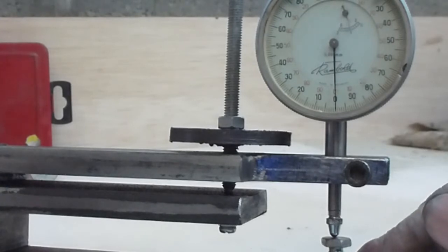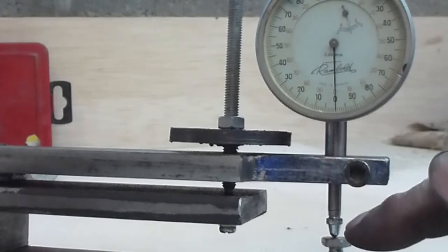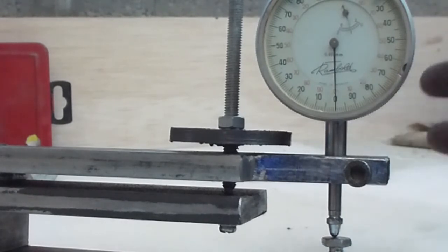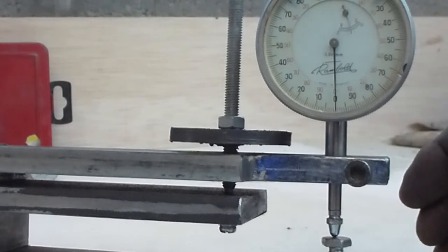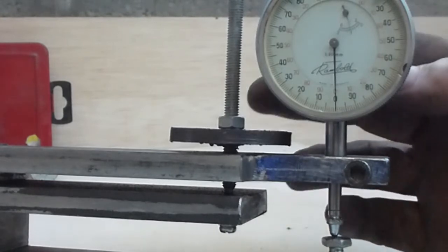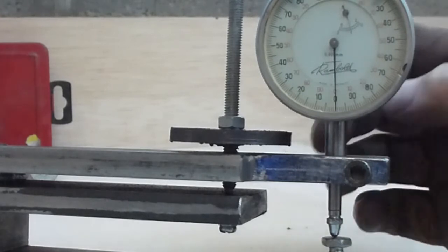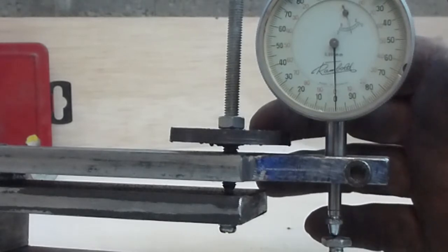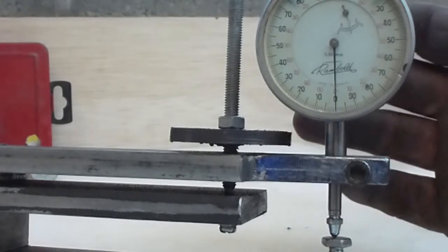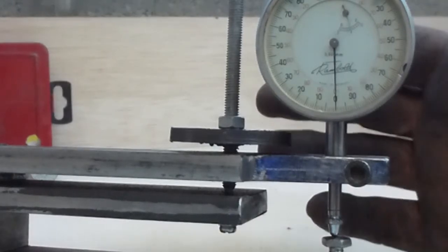I don't think that the left-right movement from here, because of the changing of the angle, is going to come into play very much. So this disc, which was the inside of a hole cut with a hole saw, the hole in the middle welded up and re-drilled, is going to get knurled and cleaned up and put in such a way that the lock nut is underneath, and that the top is flat and relatively smooth.